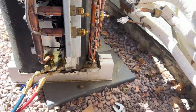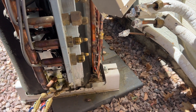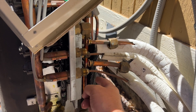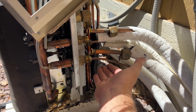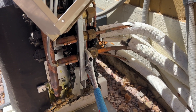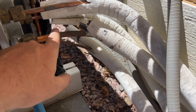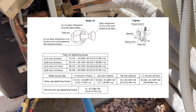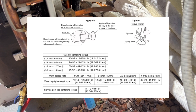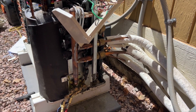The new coil doesn't come with insulation, the thermistor clip, or anything - I had to take the clip off the old one. We're doing the quarter-inch fittings first, because on these Daikins if you put the larger ones on first they get in the way. Quarter-inch lines torque to 15 Newton-meters. The three-eighths torques at 33 Newton-meters. I initially thought it was a five-eighths but it's a half-inch, so I adjusted the torque off camera. We're going to pressurize with nitrogen and if it holds, start putting it back together.